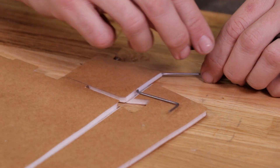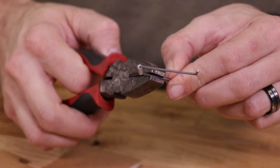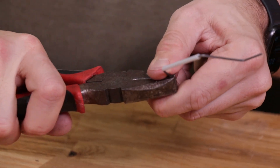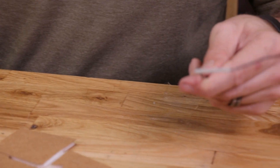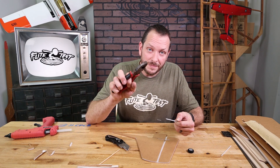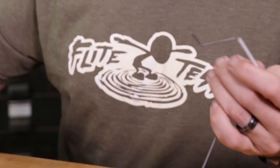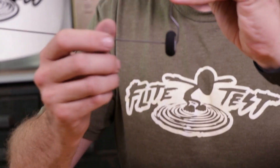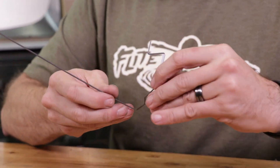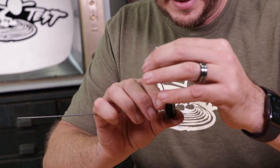As we lay this up, we're going to want our wheel placed right around here. Grip just ahead of where the wheel diameter is, bend it 45 degrees out, then grip as close as possible and bend it 45 degrees back parallel. Place the wire down so the axle is right about there. If you're using blunt-nose pliers, it's the same width on both bends. Bend that 90 degrees, then go ahead and slide the tail wheel on. You can always make small adjustments after placing it on there.